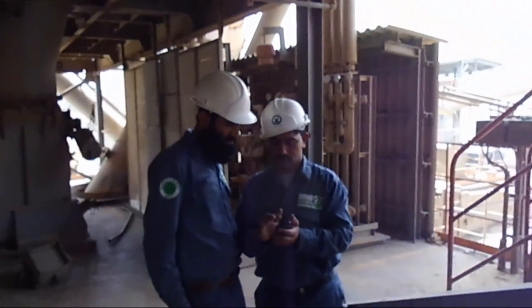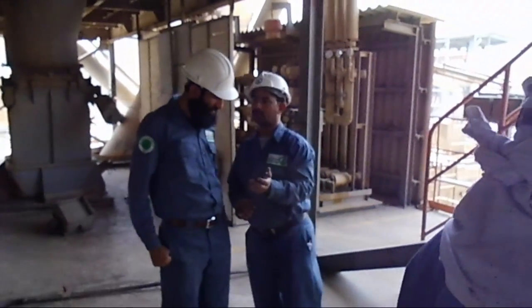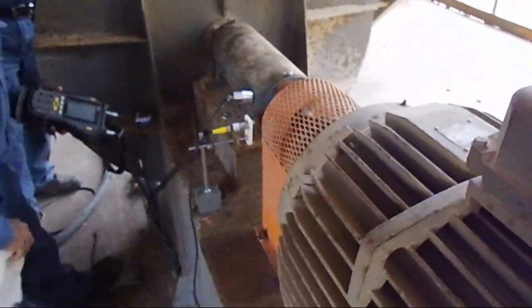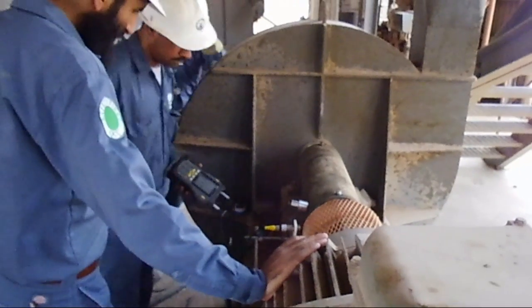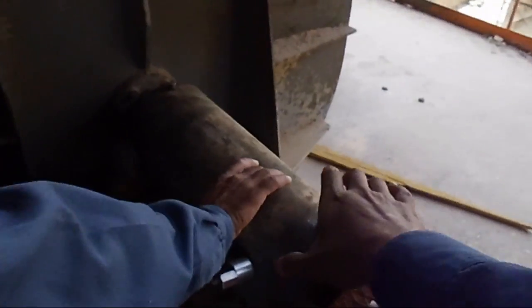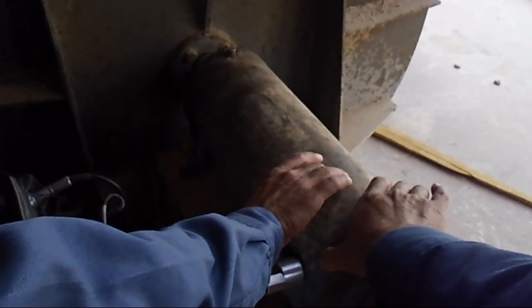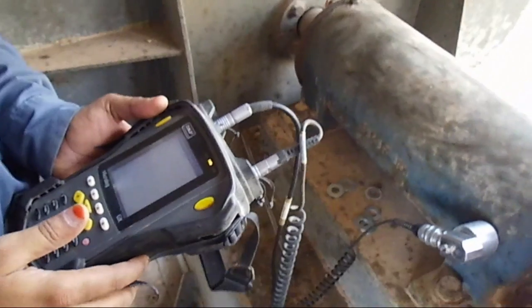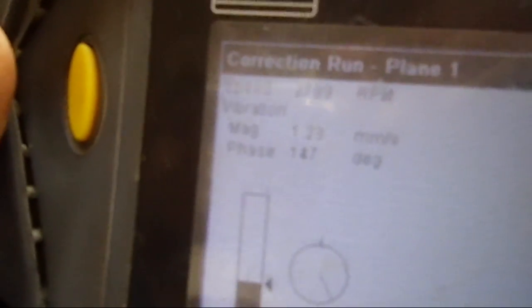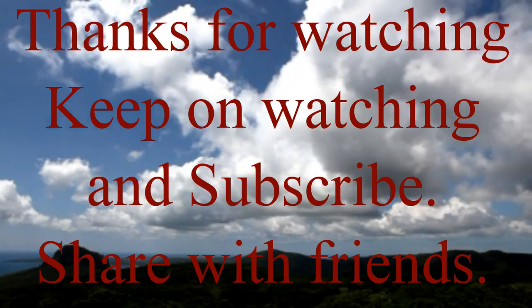The team is making final calculations. We are taking confirmation to restart — it's okay, we are ready to start. The machine is started and you can see the motor running. Now the vibration has dramatically reduced. You can see 1.5 millimeters per second — voilà, very nice — at 153 degrees. We have achieved a successful balancing on this point. Thank you for watching; keep watching and I will bring more videos — please share with your friends.